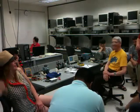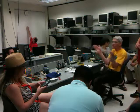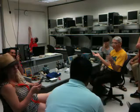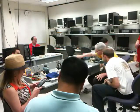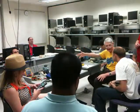3.8 milliseconds, that's a small amount of time. What's the large amount of time? Is it 60 hertz? We trust Rocky Mountain Power is doing 60 hertz? Yes. So what is the angle now? 82. Pretty close. I didn't set the cursor quite right, so within experimental error, we got our 90 degrees phase shift.